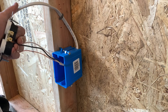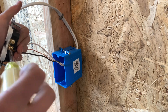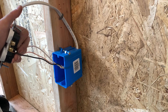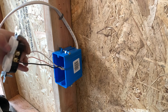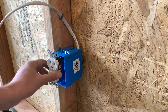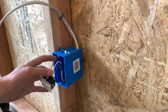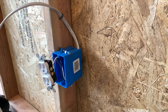This one's pretty good. I'm going to tighten this one down, then tighten it with my flat blade. Then you're just going to want to fold this back up like an accordion. Make sure when you put this into the box that your ground wire is not touching your other screws — like the hots or the neutrals.